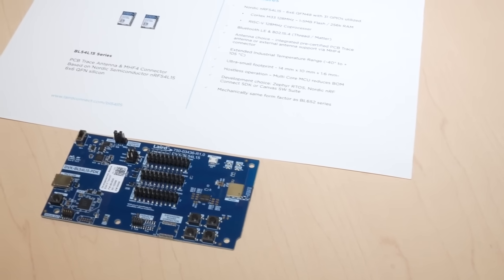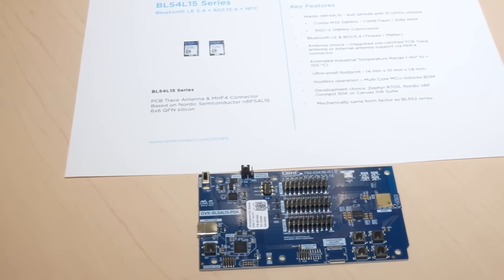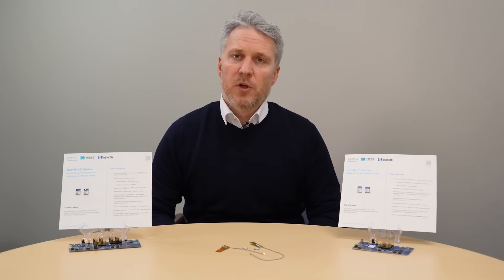On my left-hand side is the BL54L15, the very capable mass-market smaller brother of the NRF54H20. It is really a stripped-down variant of the BL54H20. It has the same underlying radio core, but it only has a single Cortex M33 clocked to 128 MHz. It's got a megabyte and a half of flash, 256k of RAM, as well as a single RISC-V coprocessor to support a range of peripherals. Again, all the GPIO of the chipset are brought out to the edge of the module. Very similarly to the H20, two module options: one with a trace PCB antenna, as well as the option for the MHF4 for external antennas.